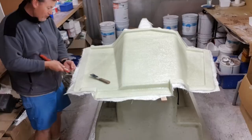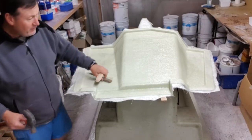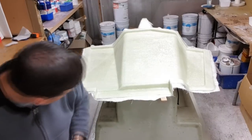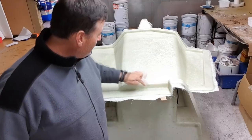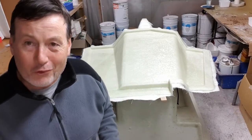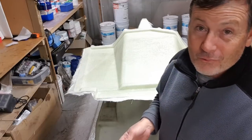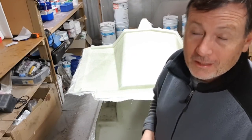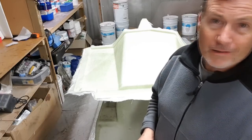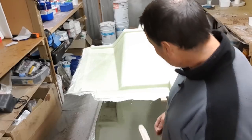It just wants to get off — it's pretty much all the way around. There will be some stubborn spots in around hard edges, but the key is just to work gently. Don't get aggressive with it because it's not going to help. I've had products that have taken me a day to get off the mold. It's a patience thing, and the product ends up being better if you're not smashing it — no gel coat repairs at the end.